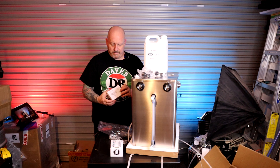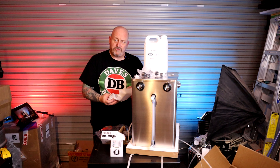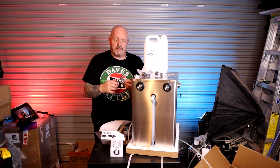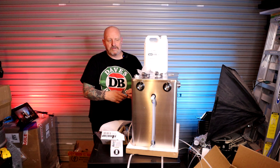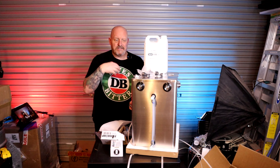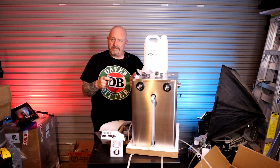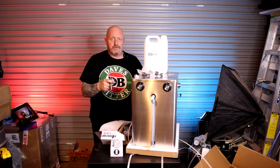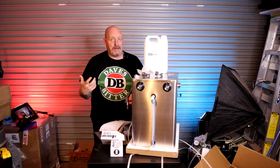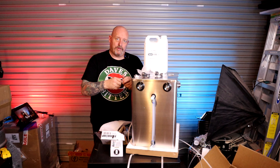I'll get this together and have a look. I'll note while we're here that they are flow control taps. The reason they give you flow control taps is because you could have varying lengths of line at festivals and things. Also, you might use a different gas — beer gas for instance — and have to up the pressure. And if your beer is warm and you're pushing it at higher pressure, that's where flow control taps really help.